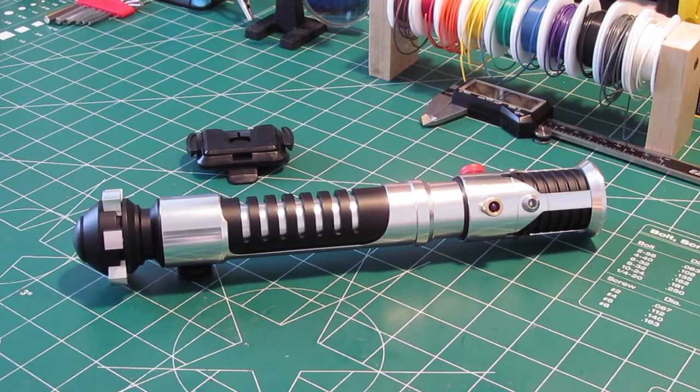This is running a Nano Biscotti V3. It has a Tri-Cree Royal Blue, Royal Blue, White LED. It has an 18650 3400 milliamp battery from the Custom Saber Shop, and it also has a 2 watt 28 millimeter bass speaker, which is generally not something that will fit in one of these hilts. You have to make some custom modifications, which I will show you in a little while.